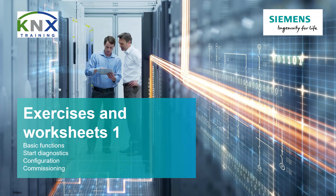From a methodological point of view, the course starts in Worksheet 1 with getting familiar with plant design in ETS. A simple project with the common basic functions — switching, dimming, and solar protection control — is created. The next step is to explore the workstation, the Siemens Gamma Training Kit, using diagnostic functions and preparing for actual programming. Step 3 consists of setting the individual addresses of the project devices.